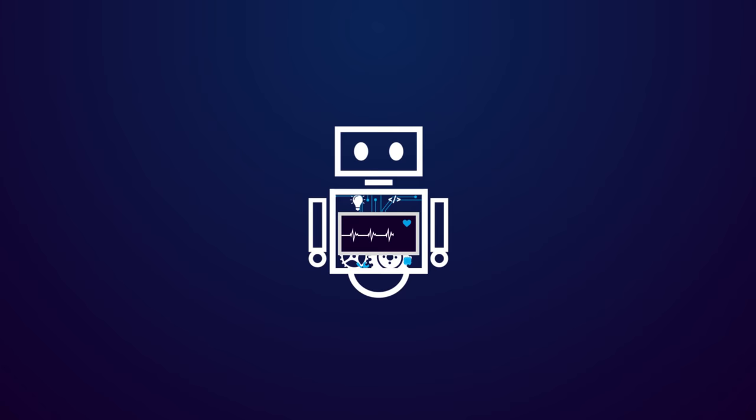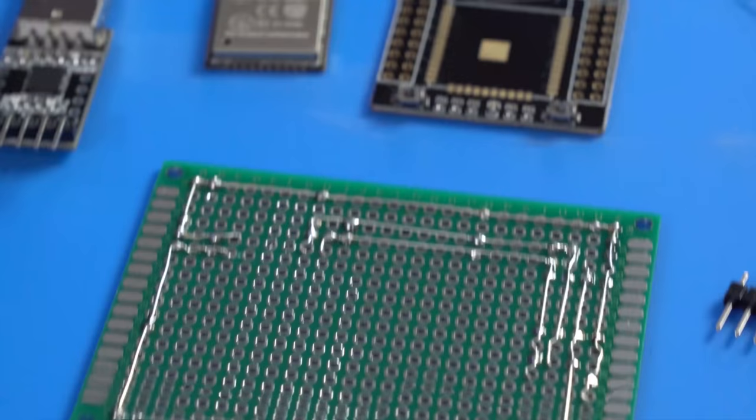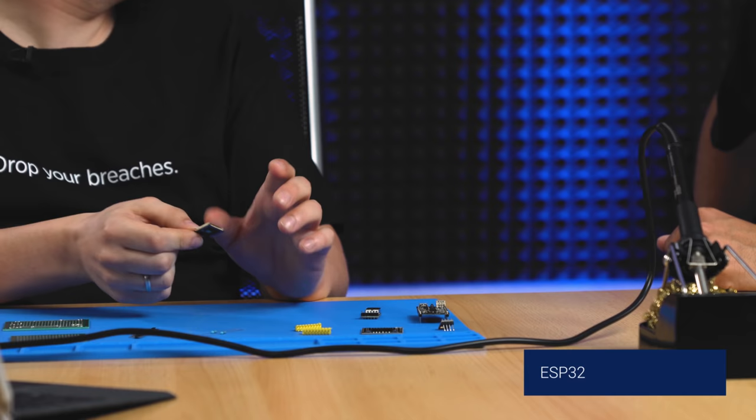And last episode we used a Ledunia stick because it's super easy. It's like this one, but all these devices have voltage regulators, serial controllers, and so on. And all this consumes a lot of energy. So we want to run as long as possible on a battery. So we will take one of these little guys, without all the controllers and so on.